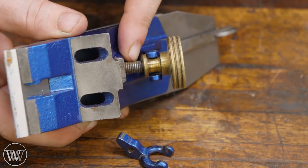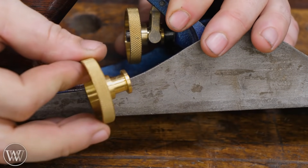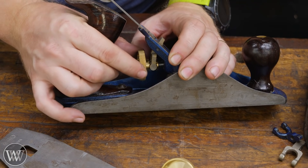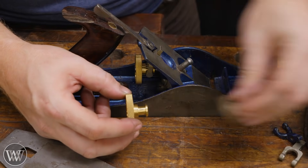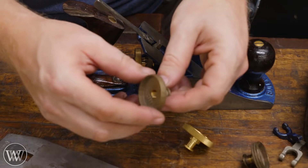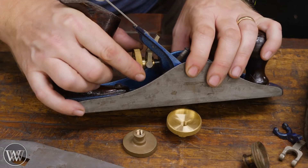Jeffrey said, what if we just made this a really fine thread? It's currently a fairly coarse thread. But what if we upgraded it and put a very fine-thread bolt in there — upgrading the bolt inside and the knob as well — so we can find out exactly where it needs to be. Now if it needs a 32nd of a turn, it now needs a 16th of a turn instead, giving you a lot more control to dial it in to get the exact shaving you want. We're also playing with different types of knobs — larger, smaller. The big ones can run into your hand on smaller planes, but they give you better control. We're also playing with casting versus milling, and the weight — hollow inside versus solid.